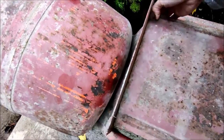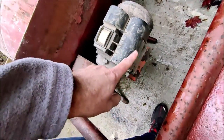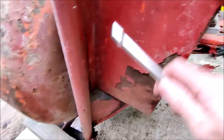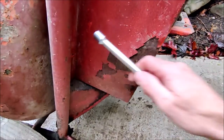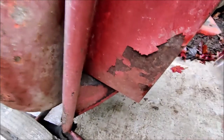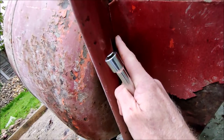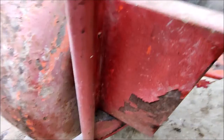On this machine you grab hold of this metal cover plate here and pull it up, and it reveals the switch, your motor unit, and then here is a cover that contains the drive pulley from the motor and the large pulley that engages with the gear mechanism and obviously the belt. It's just a case of undoing these 8mm bolts, the screws here and down here. So I shall whip them off and then we can see what's going on behind there.